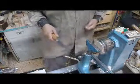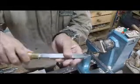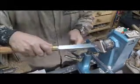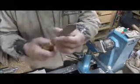I got to give a shout out to Mike Peace, who showed me how to make this on one of his videos. It's a tenon cutting tool. It allows me to get in even when the tailstock's in place. I can still get in there and make a nice little tenon. And the angles are ground so that they match up with my dovetails on my jaws.